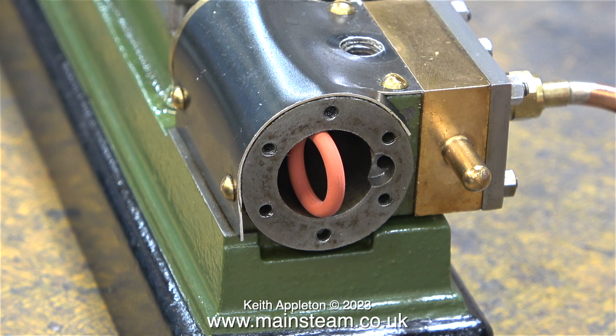When I bought the o-rings for this job I made a mistake — this one is a bit too thick. I should have bought some o-rings that were a bit thinner, but this will be fine. I'll just have to be more careful as I machine the groove in the piston, and I'll show you that very shortly.